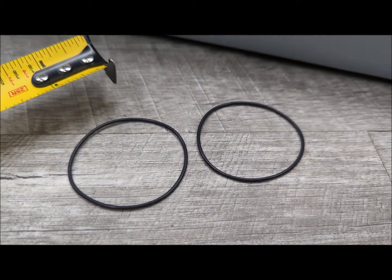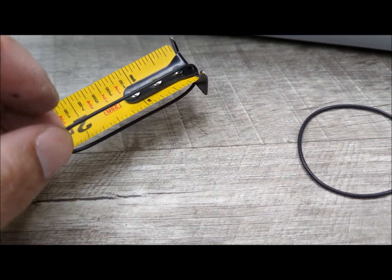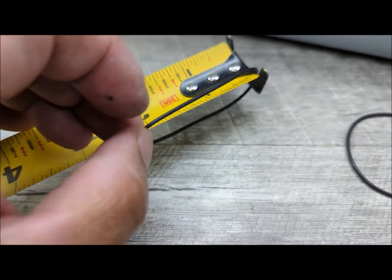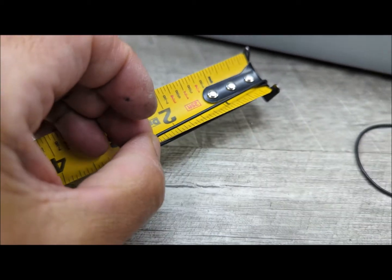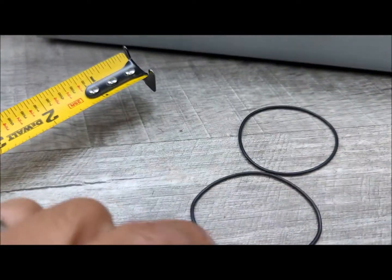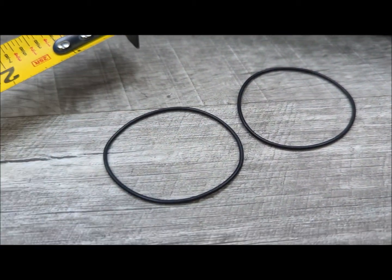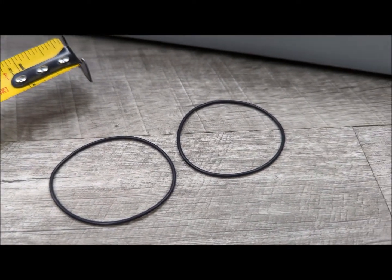And they're usually measured in inches, and how you measure it is you stretch it across a ruler like this, and the size of this is a 5.4 inch belt. So if you stretch it like this, you should be able to get 5.4 inches. If it was a straight belt, meaning that if this was cut and you measure it. But that's just how they do it. For these changers, it is 5.4. Also, you can get away with 5.5 as well, just depending on the thickness.